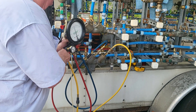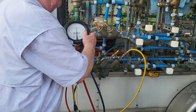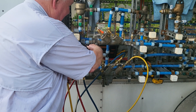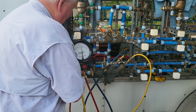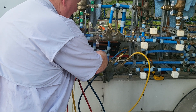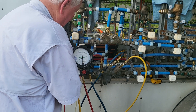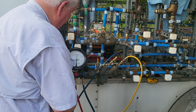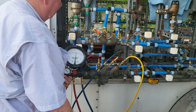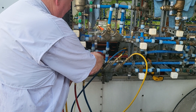I have got a leak on the gauge here — we've got a gauge leaking, we don't want to use it. I'm going to open my low bleed — gauge pegs — close my low bleed. I'm going to open my bypass; when I open my bypass is when I'm doing the test against back pressure, taking this water, putting it through the hose with back pressure right here. Okay, remaining steady — I'm ready to test number two check closed high against back pressure. Now I'm ready to test check number one: open my low bleed, close my low bleed.